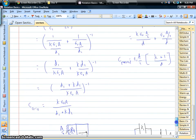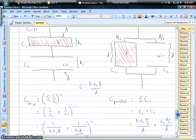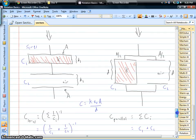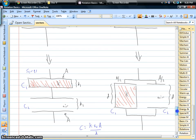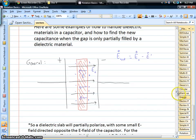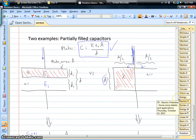So with these two examples, and this one kind of crazy one just for kicks, hopefully you see what to do when you have these things with dielectrics only partially filling the original capacitor. And then it's a bunch of algebra. Hopefully these dielectrics aren't too bad. That's really about the extent of what we're going to do with these in class. Keep in mind, physically you're polarizing the material, and that weakens the electric field, decreases the voltage, increases the capacitance, and then we can actually calculate these things. I hope this helps, and until next time, we'll see you later.